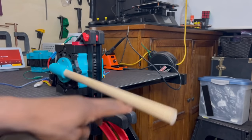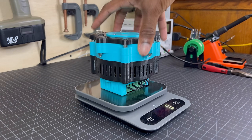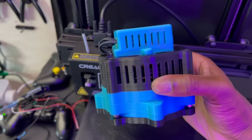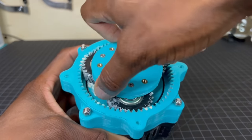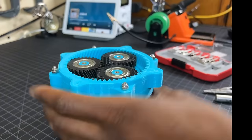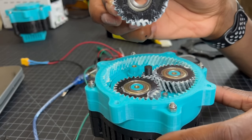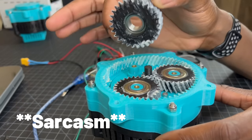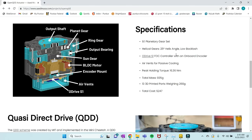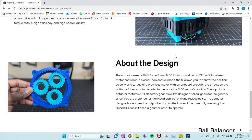Overall, I'm pretty happy with how this actuator turned out. At 935 grams, the actuator is fairly lightweight. The lower half of the actuator has air vents for passive cooling, and the output bearing is located on the inside of the actuator, which means that it doesn't need a cover to operate. You can also replace all of the gears without taking apart the entire actuator, which I totally planned for in the design. Another great aspect of this project is that it's completely open source, so if you'd like to read more about the technical aspects or even build your own, check out my website in the link below.